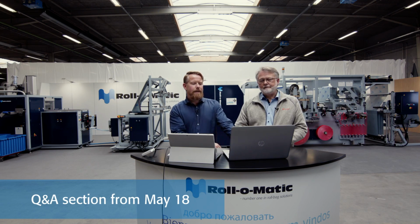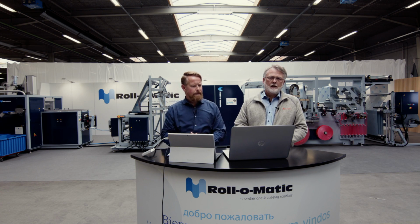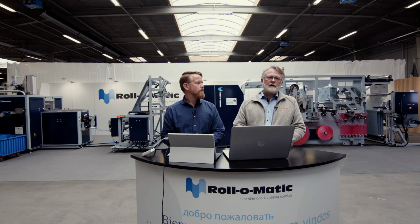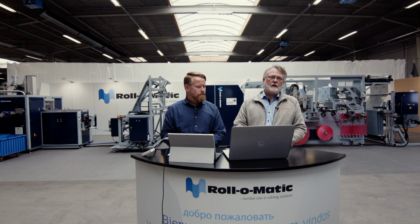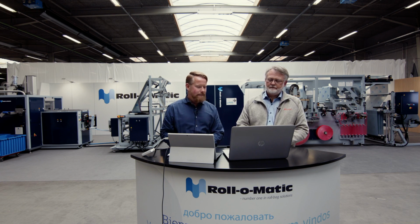Next question we have here: how is the change from outside to inside hem done? Actually, all the equipment is on the line to begin with. So you have folding equipment to fold both inside and outside. So you basically just redirect the film around the other folding equipment, and this way you can run either inside or outside hem.